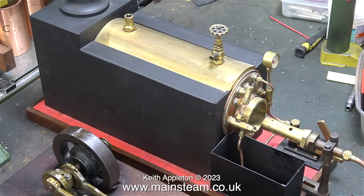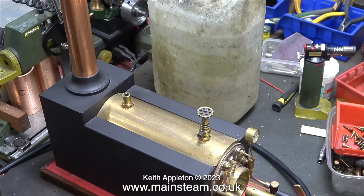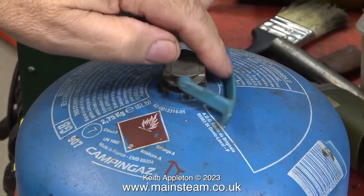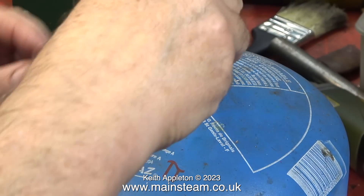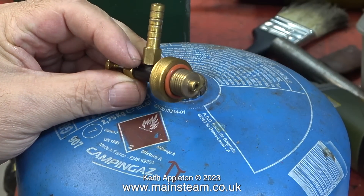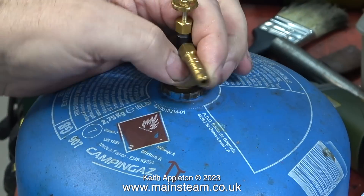It's quiet. Normally I would use the propane-butane canisters, but in this one I'm using a large camping gas canister — this is butane — because the burner does not consume too much gas. The rate of evaporation inside the gas cylinder is quite small, as you can clearly see in these clips. This canister is quite large. The gas valve is a commercial one in a fitting that I made, and it's a 16mm thread which fits the camping gas cylinder perfectly, fitted with a steam-grade silicone O-ring and it is 100% gas tight.